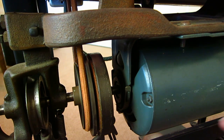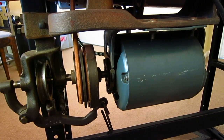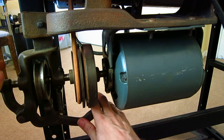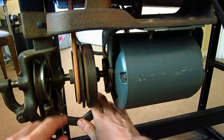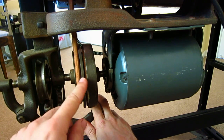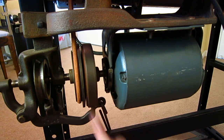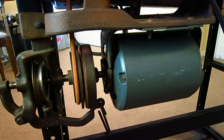What basically happens on this clutch assembly is when you press down on the foot pedal, it pivots and it pushes this disc — which right now is not connected to anything except for the drive belt, the leather drive belt. As you press this down, this disc will catch on the cork pad here. This is constantly spinning — you turn the motor on and it's just always humming. You depress the pedal and it catches on this cork, and this is how you feather it.